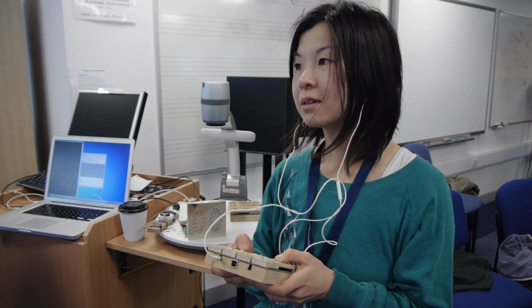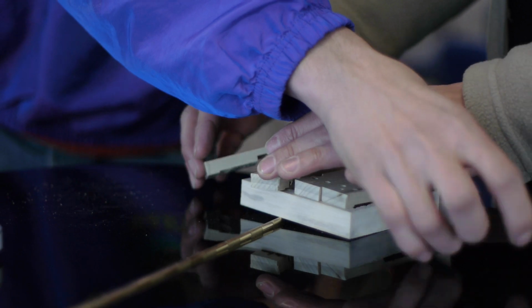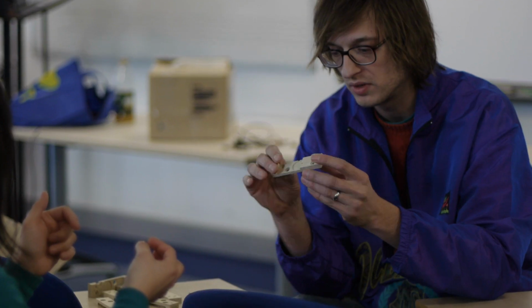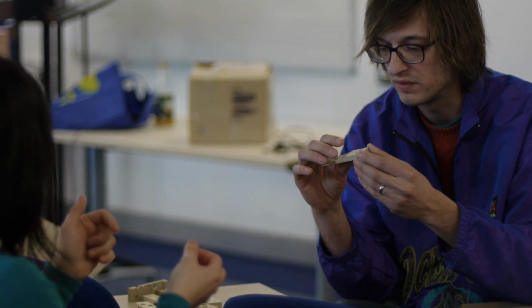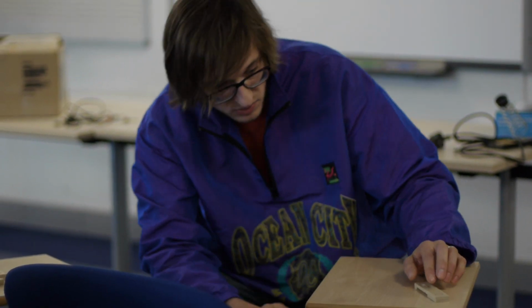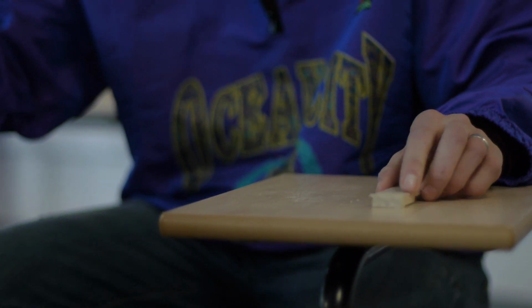That's much better. We chose poplar because it's easy to machine, and sycamore for the back because it has that nice grain on it that looks like data. The bar's going to flex. There's a piezo that goes there. And then this is the bar stop. The flex stop prevents the piezo from breaking, but it needs to be tuned. You see how there's a little bit of space beneath it? That's a good one. It's going to flex, you can see it flexing and then it stops it.